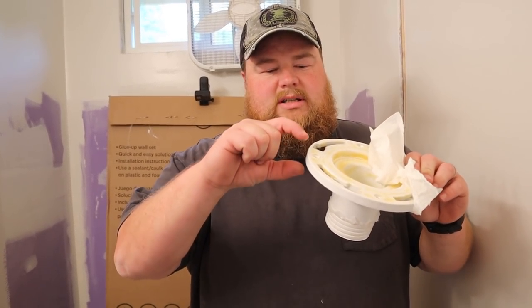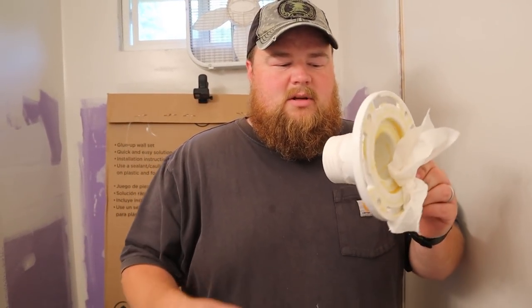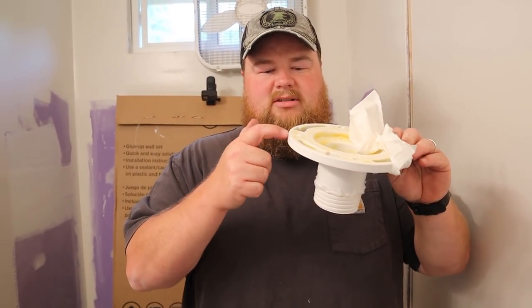The toilet is now down, it is sealed up and everything, and honestly, there's been probably about 2 hours time lapse from the first wax ring that we put down, the really cool gray and blue one, to where we're at now. We had to go get a second wax ring because that first one got destroyed, because the first flange, this one, was too thick, but more importantly, was not the correct fit for our pipes. We were trying to cheat and make it just work this way with silicone, but came back to actually have problems with the depth, so took it all out. We have one down there we glued, which is correct, and have a thinner, smaller wax ring, which is also correct.